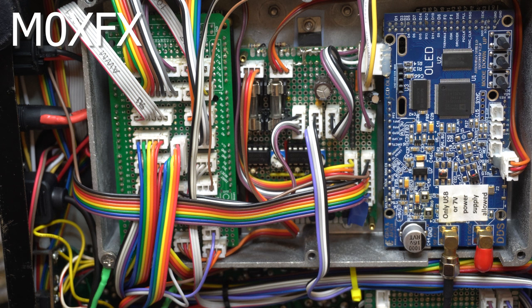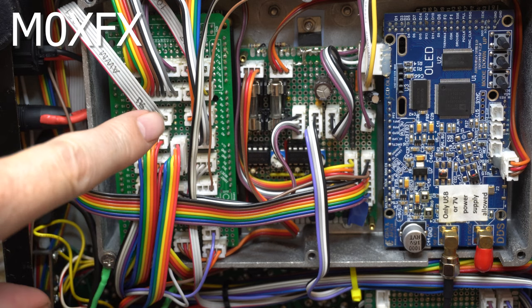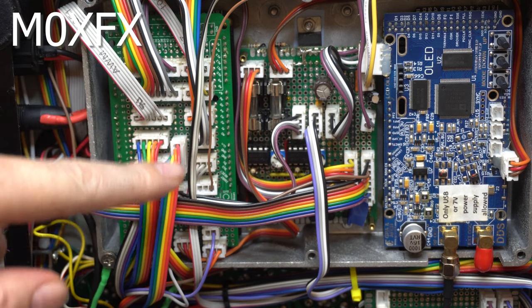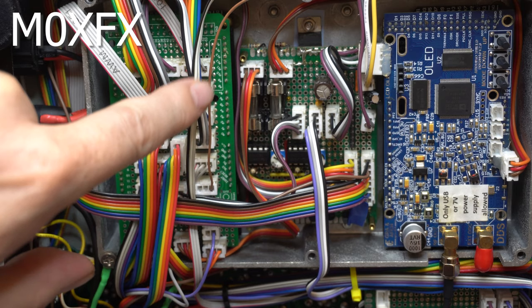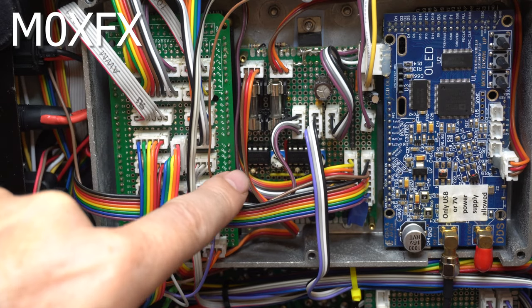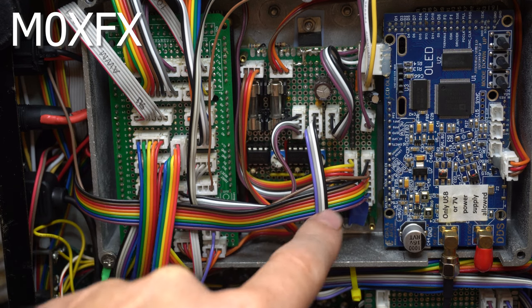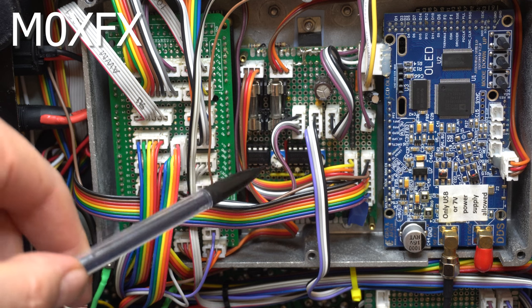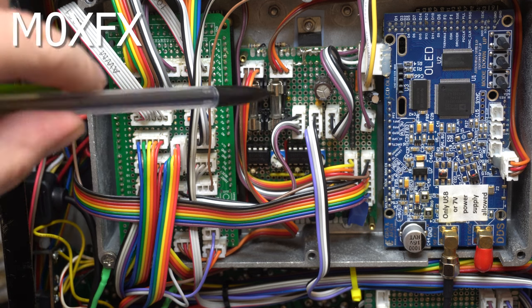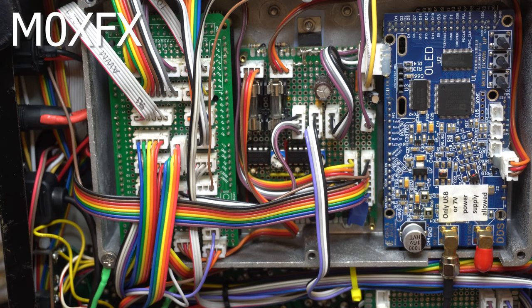Over on this side there's another Arduino Mega handling voltage outputs. Because these Arduinos only output PWM signals — no built-in DAC — I'm using op-amps and capacitors to convert PWM to clean DC. There are four op-amp stages. It's a bit tedious but it works and gives clean DC, though the reaction speed is limited by the capacitors. In the next video we'll go through more of the microcontroller functions in detail.